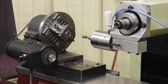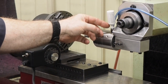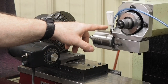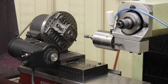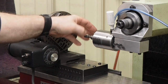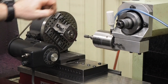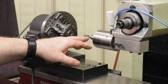One of the things I've noticed is this air spindle has the muffler right up here. The other one, the 550, had it on the cable and it was dangling down. This one seems to actually be about half the noise — noticeably quieter. Another nice feature is it's always blowing air — you can feel air coming out pretty good in the front, so it's blowing air over the work area and keeping all the debris away, though it does make things messy.